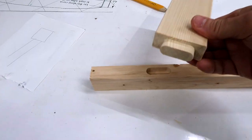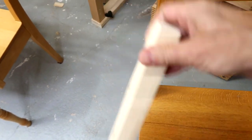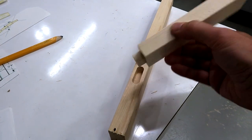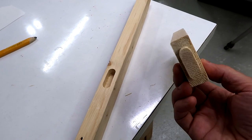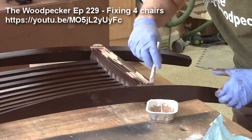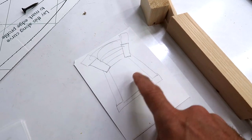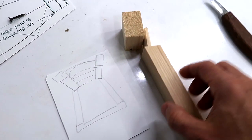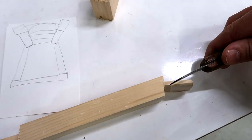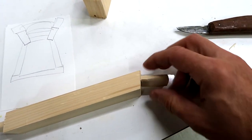Some of that is because on chairs with trapezoidal seats, the back legs might be angled one way while the rail is angled another way, meaning the parts join at quite an angle to the leg. When you put the tenon on the end of the leg at an angle, that inherently weakens it and it's very difficult to make a long tenon. So you end up with stubby angled tenons that often have a corner missing — just the way it was cut out of a piece of wood — as you can see in my friend Alain's video. If you make a long thin tenon going into the angled back part, the wood grain runs straight along the piece but not along the tenon, so it would just split. Being long doesn't help if the grain doesn't run along the tenon.